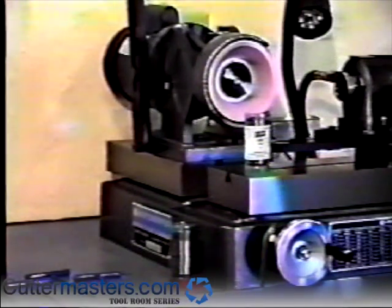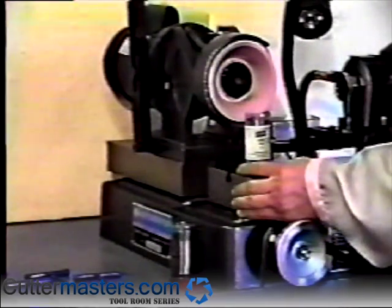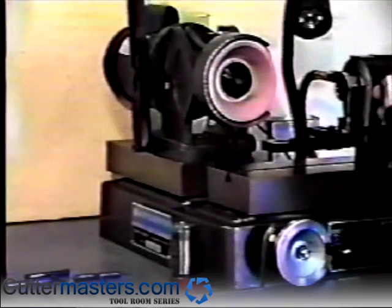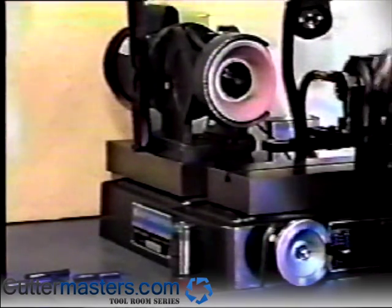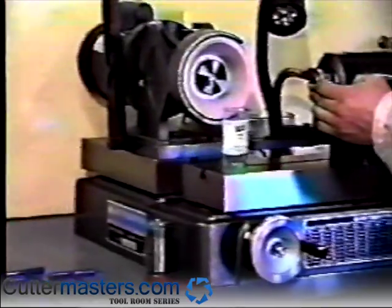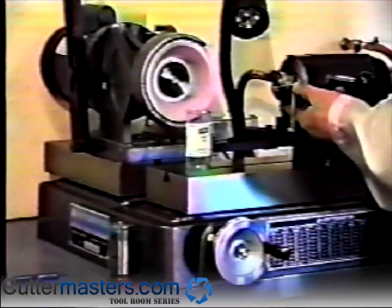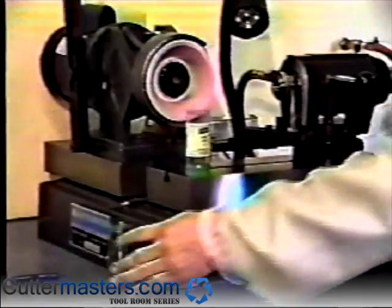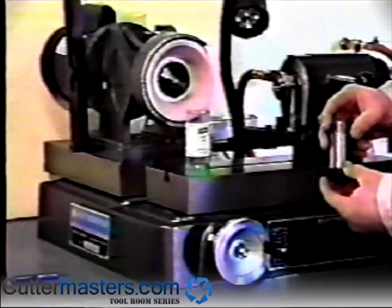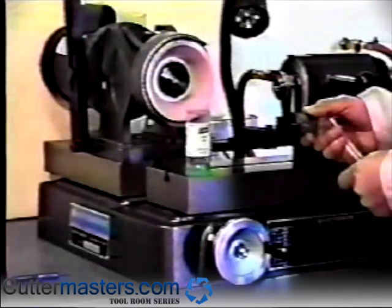If you'll be sharpening tools and need the closest tolerances possible, Hardinge 5ST 4-split collets provide the best concentricity possible in a 5C collet. With a 4-split design and a deeper throat, Hardinge 5ST collets can hold concentricity within 5/10 and better. Hardinge 3-split collets are a close second best, providing concentricity between 5/10 and 1/1000. Other 5C collets can be used. Please consult the manufacturer.